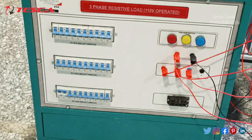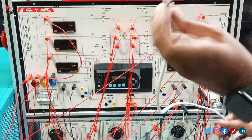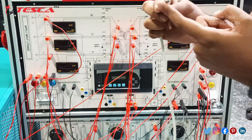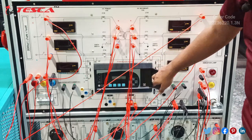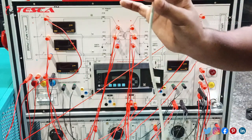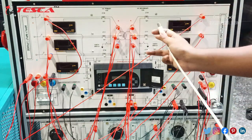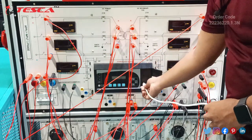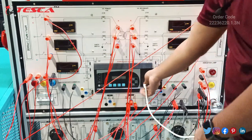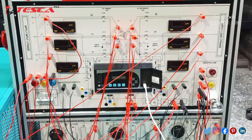In the last, to connect with the fan, we just have to give supply from this power port and neutral port. This is connected — and this one is connected with this. Now, these two have to be connected with the three-phase resistive load, in which there is a fan option — we have to connect it with that. That power port should be connected with this red port and that neutral one should be connected in this black port. Here we are done with the connections of the differential protection relay trainer. This shaped cable should be connected into the differential protection relay, and its USB part should be connected with the CPU. Here we are connecting this cable with this differential protection relay. Here we are done with the complete circuit of the differential protection relay trainer.